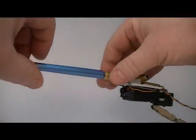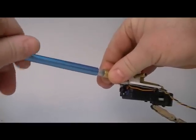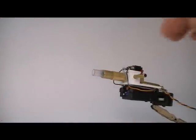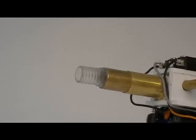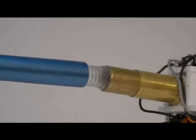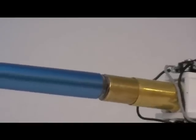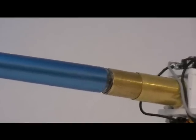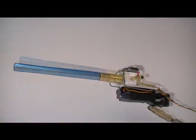Here you can see the ballpoint pen assembly and how it's used. Normally this is what you use to take apart the ballpoint pen. What I've done is attach that threaded portion to the brass tube that slides inside the cylinder, and then I make the barrels out of the other end of the ballpoint pen — see how that just screws right on there. This particular brand of pen works great for a Sherman 75 millimeter cannon. If you want more length, just add more brass tube to the end of this. There you have it.